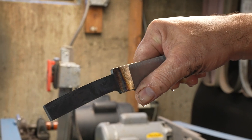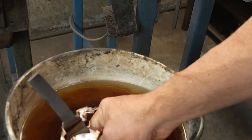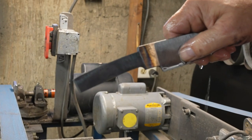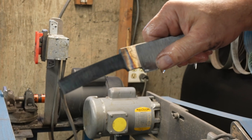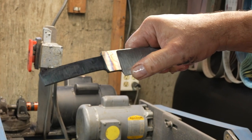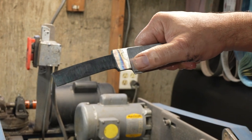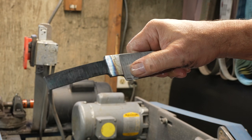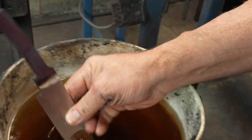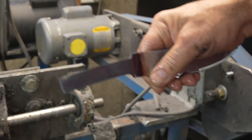And it's getting hotter because the heat now is traveling through and coming down. So until the heat's out of the tang, I got to babysit this, so it doesn't creep around that corner. Because this is thinner than the Ricasso, it acts like a heat sink. It just wants to draw the heat out quicker. And I almost think she's getting where it's safe just to put it down.